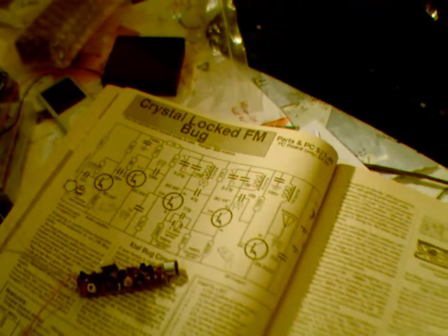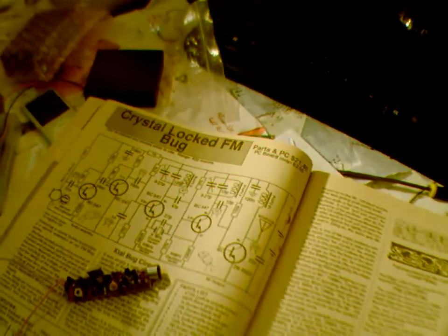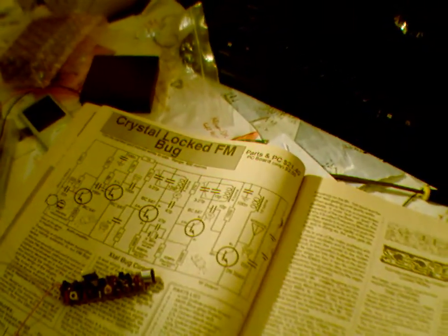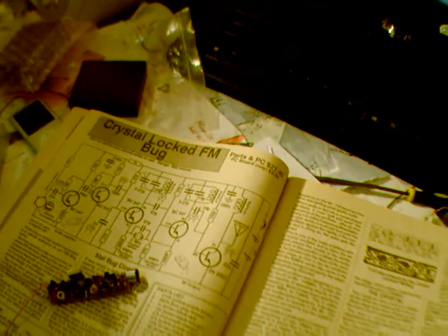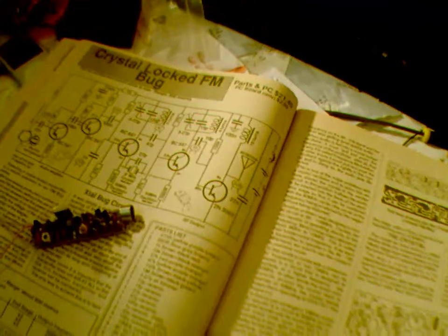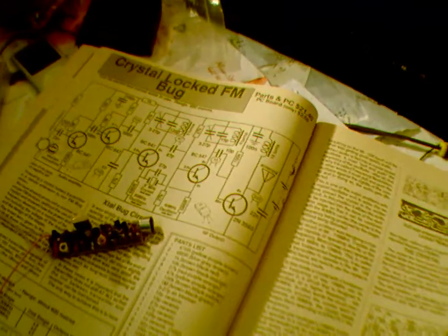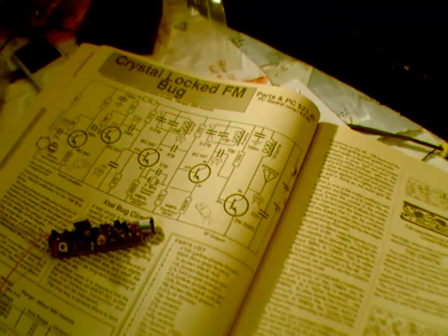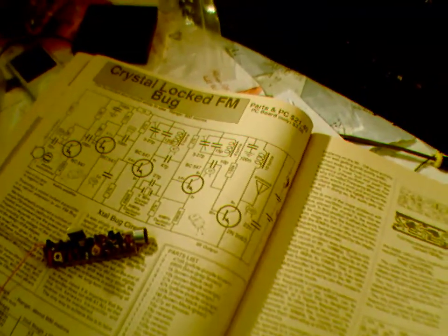What's the simplest design for a 10 watt, 40 meter, 80 meter CW nonlinear amp? Well, maybe something using an IRF510. Although for 10 watts, I think you probably need a higher voltage, say 20 volts or something, to give you 10 watts. Most of the QRP designs you see are for 12 volts, but with an IRF510, if you want that sort of power, you want a bit higher voltage, which might not be so much of a problem if you've got a switch mode power supply.